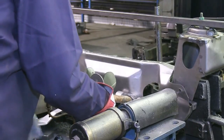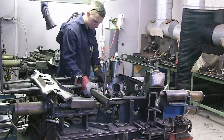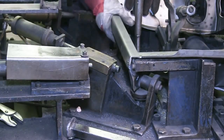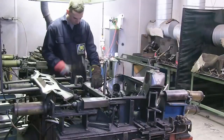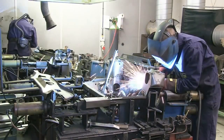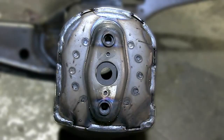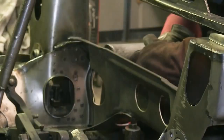The jig closes to hold the rear crossmember in place. The front crossmember is the last subassembly to be placed and locked into position in the jig. The main components are now held firmly in place, ready for MIG welding. Short stitches of weld are applied, a technique that makes a strong joint, but doesn't provoke the work to distort under the very high temperatures produced by the welding.